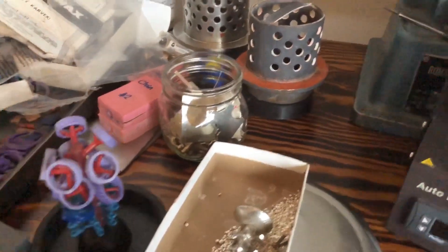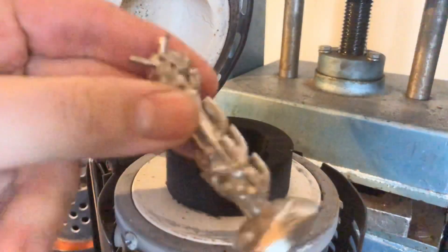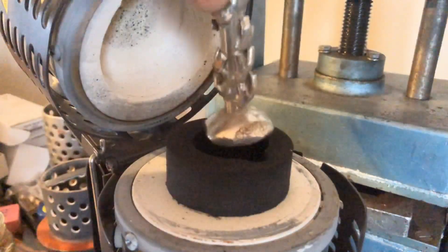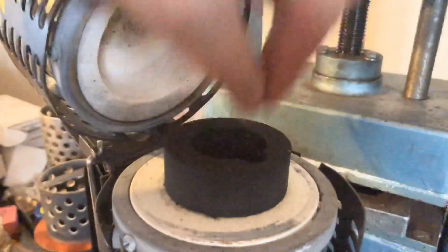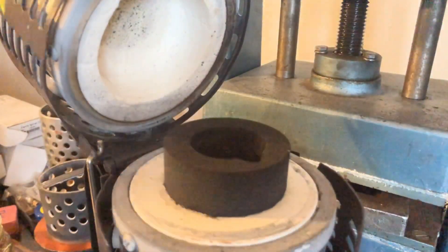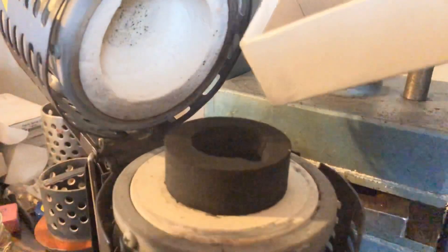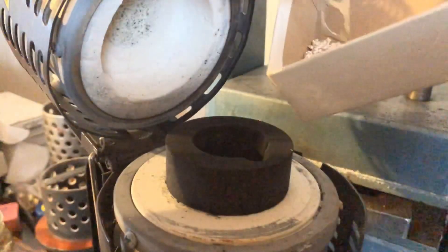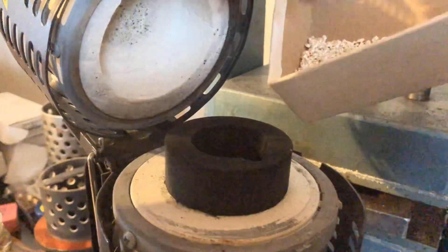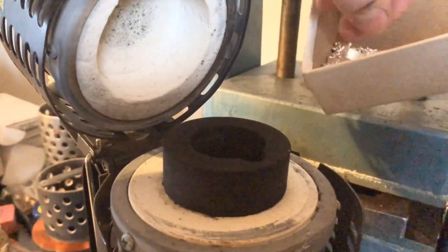When I do bronze I'm cutting up ingots into chunks, so a larger machine would make it a lot easier. I've gone ahead and squished the sprue, and I'm going to put it on the bottom because the button makes for a nice bottom cap. I'll lower that in gently, and then pretty much everything else is small enough to dump right on top — taking out any awkward-shaped scraps so they don't ruin the flow.